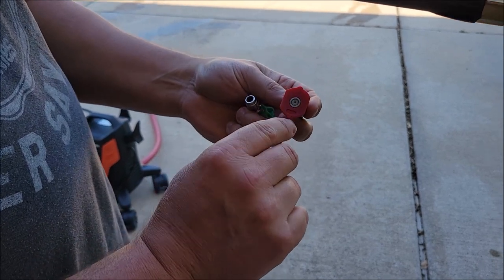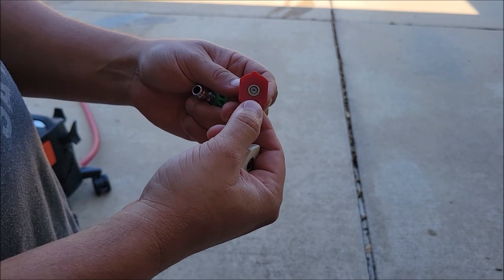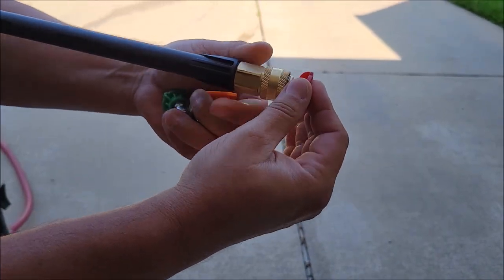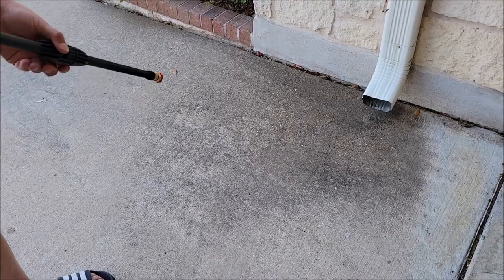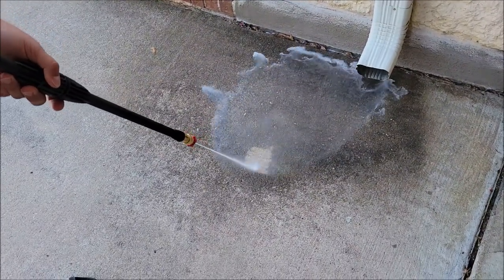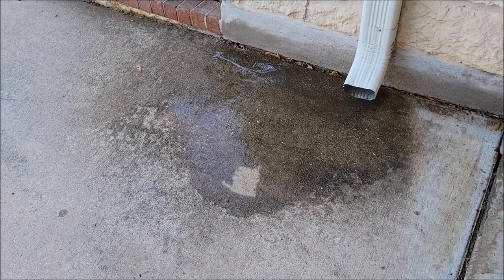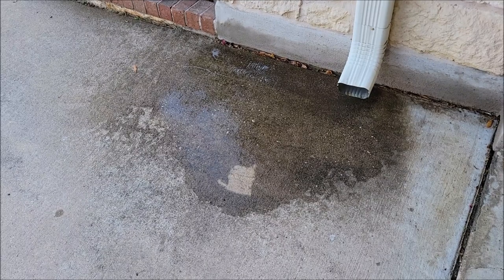It comes with four different nozzles. The zero degree nozzle has a straight stream and you need to be very careful with it — these are the kind of nozzles you can etch your name in your cement if you're not careful. It'll just blast the concrete away. I'm not going to get too close to the cement because I don't want to tear it up. It sends out a pretty strong straight stream — that might have actually been knocking off the top layer of concrete. I don't really use a zero much at all unless you really want to etch something, but there are purposes for it.